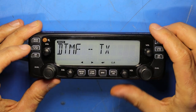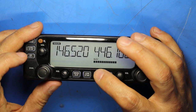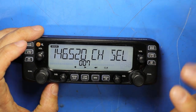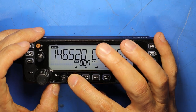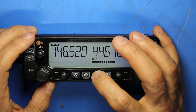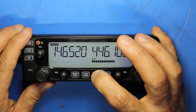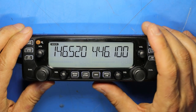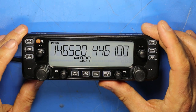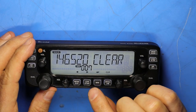Long pressing the LOW/DTMF button opens the DTMF tone settings, with modes changeable via the tuning control. Short pressing the MW button enters memory programming mode. If the radio is in VFO mode and the MW button is long pressed, whatever frequency is in the register gets written to the next available memory channel. For example, the current frequency was just written to memory channel 7, and tuning to channel 7 in MR mode confirms it's stored there.